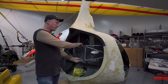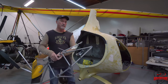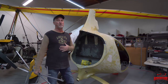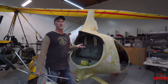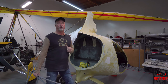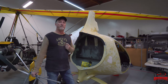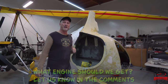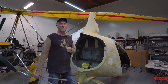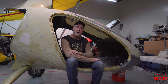The oil tank goes right here and the engine right there. This mount is for a Rotax engine and we're deciding what size we want — whether to go with a 912 ULS at 100 horsepower, or boost it up. There are people making upgrade kits with an intercooler, turbo, and different cylinders. There's a guy in Europe using a 912 boosted to 200 horsepower, but we may want to bump it to around 140 to 150, which would make it the equivalent of a Rotax 915. I also have a spare 912 sitting around we could modify.